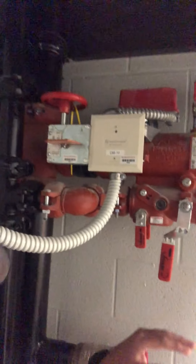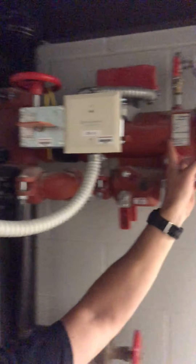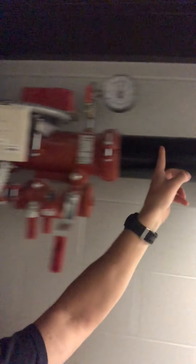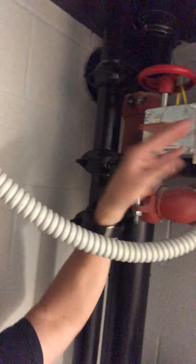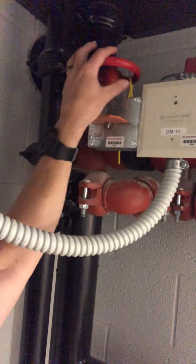I'm on the first floor here and I'm going to flip the camera around — there are a couple different components that you can see. This is the sectional control valve, or the isolation valve, for the sprinkler piping. You can see it's in the open position. It's also electronically protected, so if I go to shut this valve and I close it, it's going to send a signal back to my fire alarm control panel.